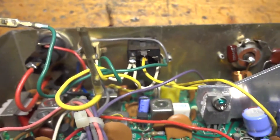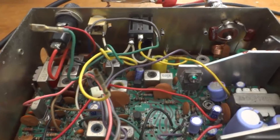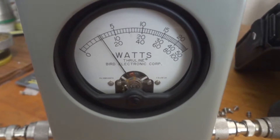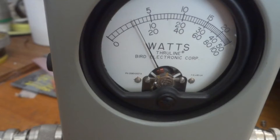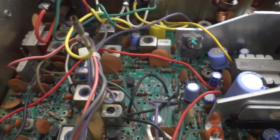Let's power up — the moment is here. We have the radio hooked up at channel 19, center of the band. We're testing the transmitter. And here is our wattmeter with the new transistor — and lo and behold, we've got our 6 watts, the same as before. We have not adjusted anything — this was just a new transistor as a drop-in, nothing was realigned. Completely original radio, never tuned up.